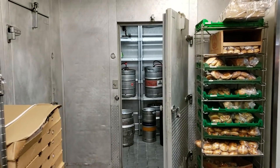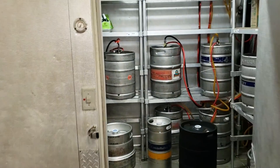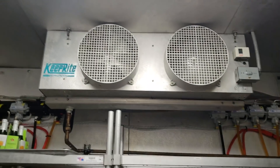I imagine this is part of the problem. I went to go get my hoses and came back and this door is wide open and it's not shutting on its own. So we're going to have to give them a price quote for some self-closing hinges, a new door closure, and a latch. But we're going to get this thing defrosted now.